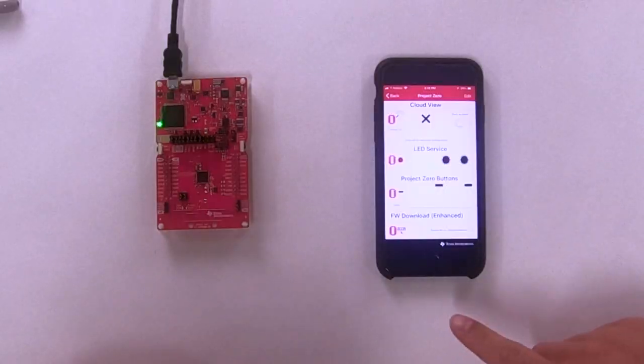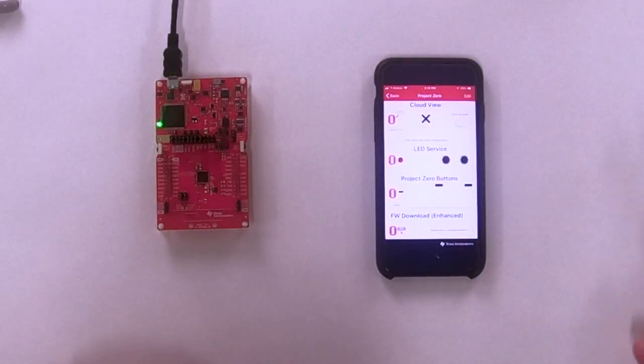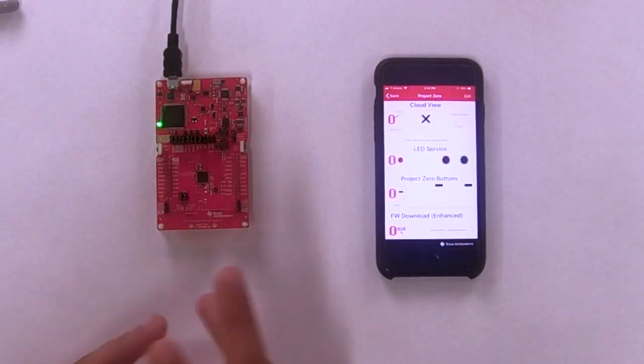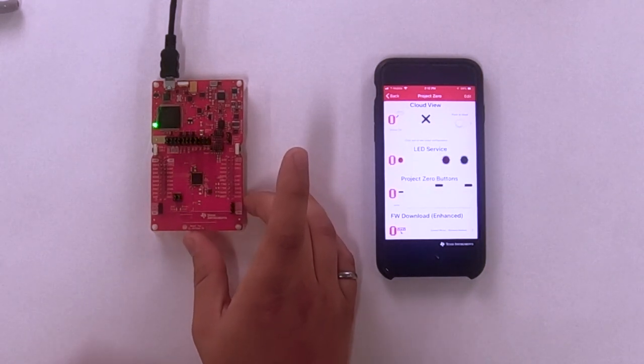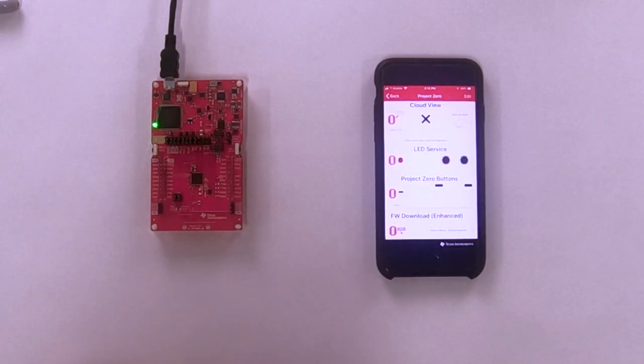You're welcome. It's a pleasure to be here. Let's jump right in here. So what we've got here is our Launchpad kit — featuring which device specifically? So this kit right here is featuring the CC2652RB device, which is our BAW device — a true single-chip solution with our bulk acoustic wave resonator integrated inside the packaging of our device. And what are some of the benefits of having that integrated into the microcontroller?